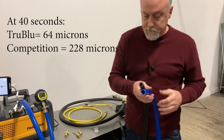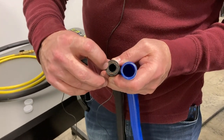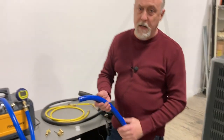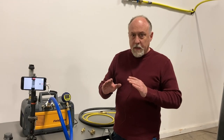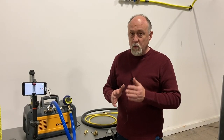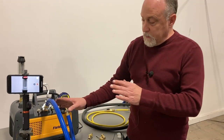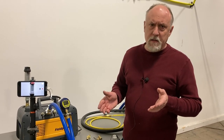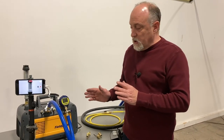When you look at these two hoses side by side — this is a triple-wall hose with an interior wall, reinforcement, and another interior wall, and it's a half-inch diameter inside. The True Blue is a full three-quarter-inch diameter on the inside. That makes a big difference when you're talking about conductance speed, because conductance speed is about friction. The smaller the hose, the higher the friction — especially at transitional and molecular flow. You can see now the vacuum gauge is down to about 50 microns, and almost all the work the pump is doing is now at the end of the hose. If we let this run a few more minutes, it'll get down to the 25-micron range — about 10 microns of loss overall in the hose — where a competitive hose will show over 100 microns of loss easily. An engineered solution is a better solution all the way around.